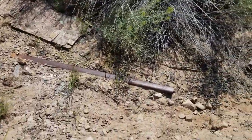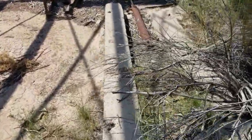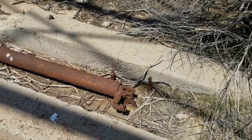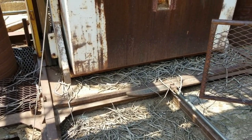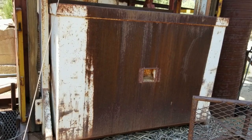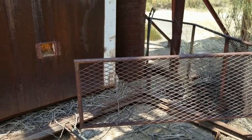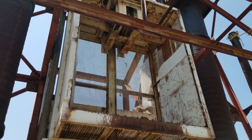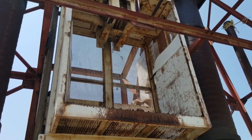There's more rail set in line with the shaft. I've got to wonder if there was rail up on this structure. We have another cool feature — a big pneumatic ram (I haven't found a hydraulic pump, but there's a big compressor) that opens and closes the shaft door, so the shaft door can be closed mechanically and remotely to control access. There's your swing gate. This is the skip, and up on top of it is the cage, which has its own doors. That cage is probably three feet by seven feet — you'd only fit three guys in there, four if they really like each other.